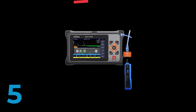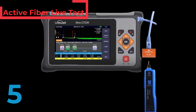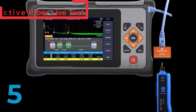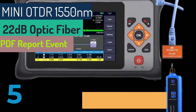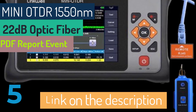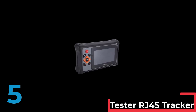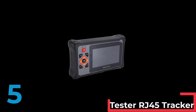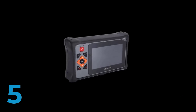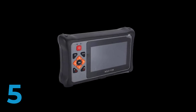Active Fiber Live Test Mini-OTDR. The Active Fiber Live Test Mini-OTDR model ATO-A1E-S22F is an advanced fiber optic reflectometer designed for single-mode fiber testing. Operating at 1550 nm with a 22 dB dynamic range, it offers precise diagnostics and event mapping. This compact device comes with hybrid connectors for versatile compatibility and includes features like a PDF report generator and an Ethernet cable tester with an RJ45 tracker. Available in black and orange, it's a robust tool for field technicians. Certified by CE and originating from mainland China, this OTDR ensures reliable and efficient fiber network maintenance.